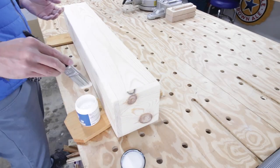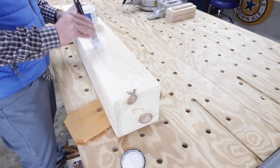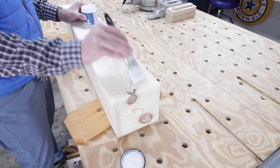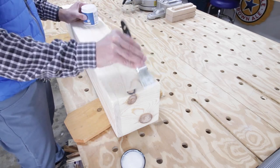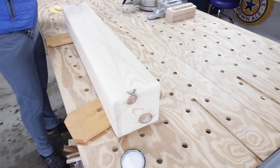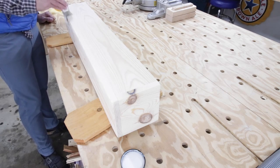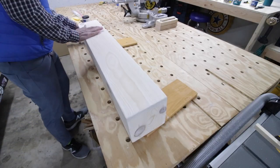For the color, I found a really cool trick. I'm using a water-based wood stain in a white wash pickling color. I went all over the front of it — it's hard to tell it's going on, but you're gonna see a big difference when I put on the next coat. After the first coat dried, I sanded it with a really fine sandpaper.